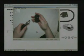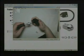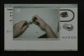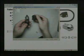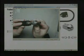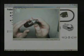So here we have a little tubular lock. This is actually a lock for a firearm, but we'll talk about gun locks in a bit. I just stick this into the lock and wiggle, and I can feel them binding a little bit, and I can feel the feelers are pushed down, and that's open. So not only have I opened the lock, but I've made impression cuts that are the right heights for the key.